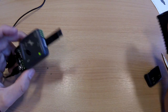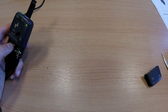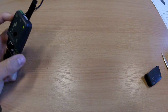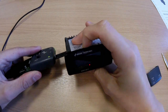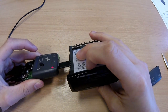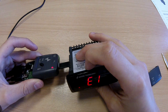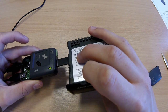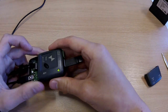And then to transfer all the parameters from the key to the controller, you need to set the DIP switches to on, on, on, on. Plug the key into the controller and press the start button. Once the LED goes green, the process is complete. Remove the controller — that controller is now programmed with the previous controller's settings.